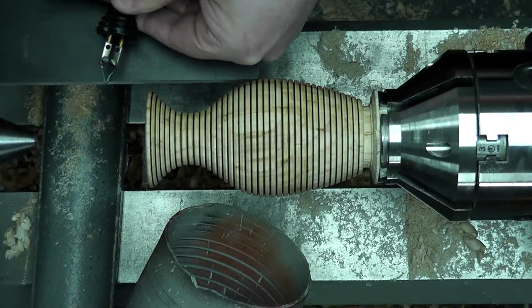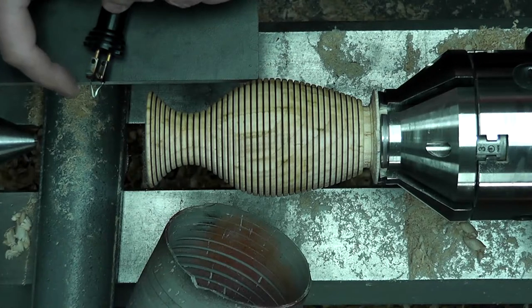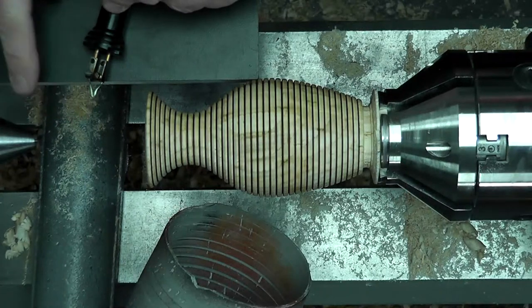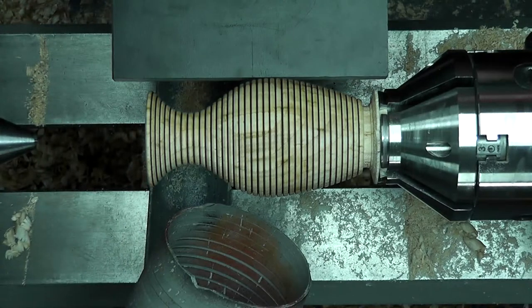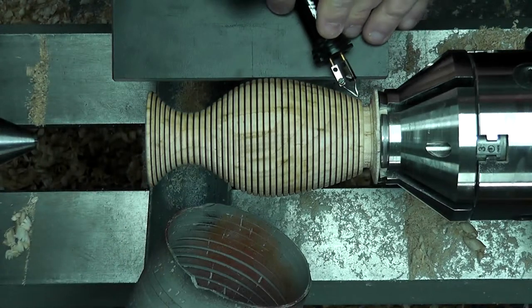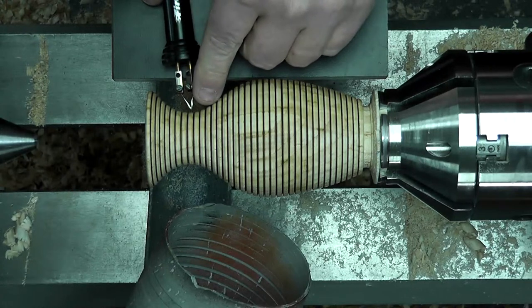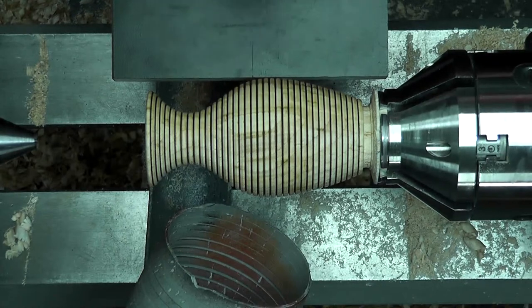I don't know whether that was in shot then when I did that, but now when I put my pen down, I'm actually going to have the nib of my pen on the center line of the lathe. Okay, that's really important. Otherwise, as we burn along here, the line goes up high on the smaller diameters. So it has to cut that center line all of the way.